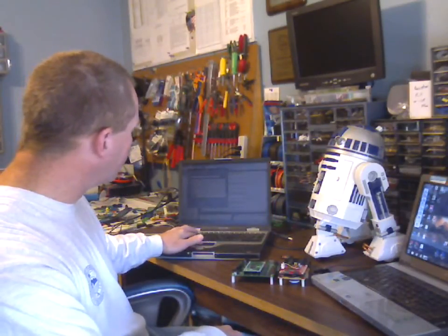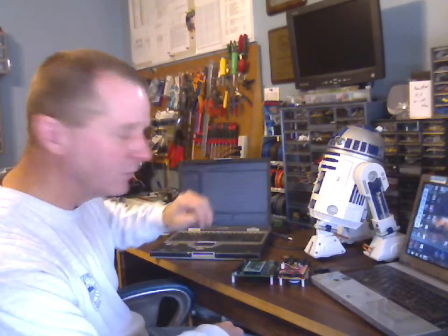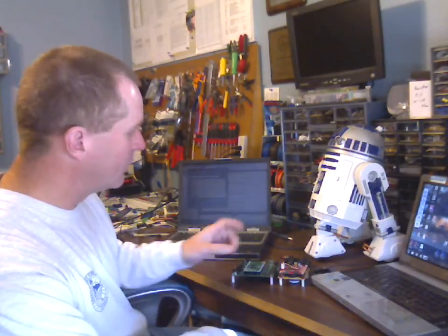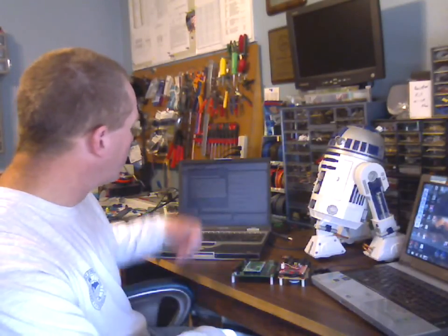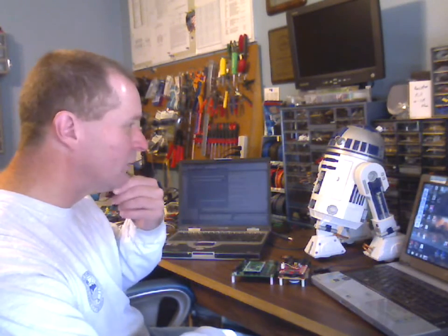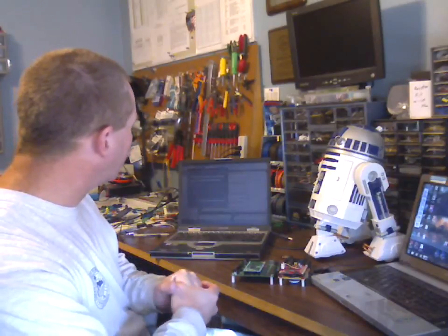The C file is back here, and this is where I have the logic for all the voice commands set up — the hierarchy of different commands and responses. And then there's the Quick Text-to-Speaker Independent software, which is the development platform where you actually program the phonetic acoustic model and grammar models that the chip uses to process the sounds it hears and determine whether or not it's hearing a phrase. You type in a text phrase, and it converts that into the appropriate phonetic alphabet sentence. It really streamlines the development process.